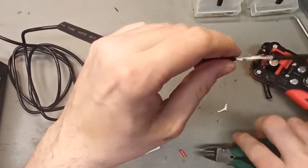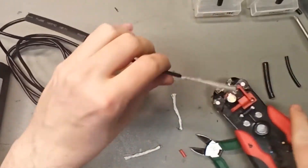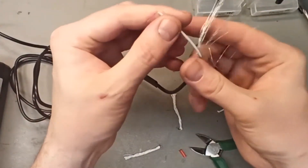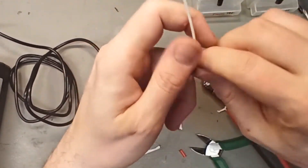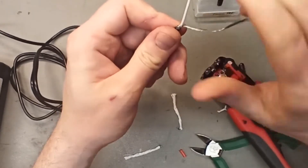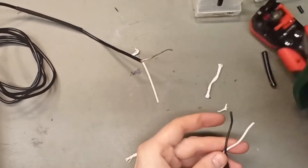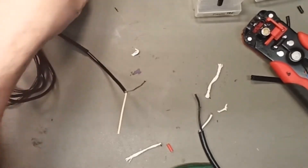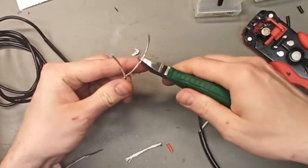I don't like working with these. Damage them just a little bit at a time. Here you can see MDA uses white for positive and black or none for negative. I want to get as many strands as possible, though not all of them are needed. I'm going to cut off 50% of that one, and the other 50% I'll pre-solder a little so I don't have a thousand tiny sharp things on my desk — then cut them off so they stick together.